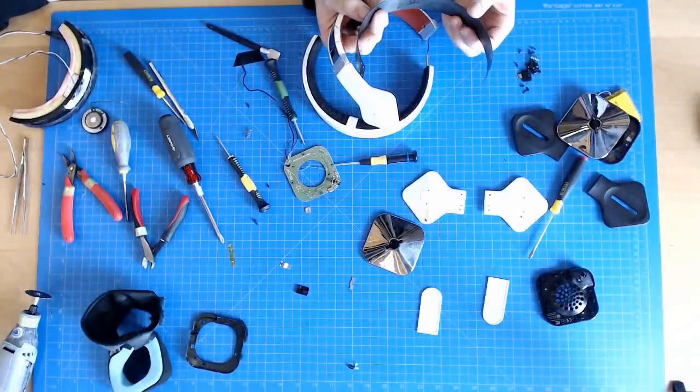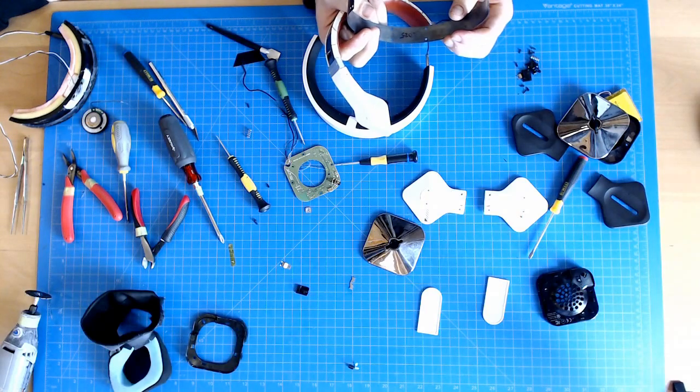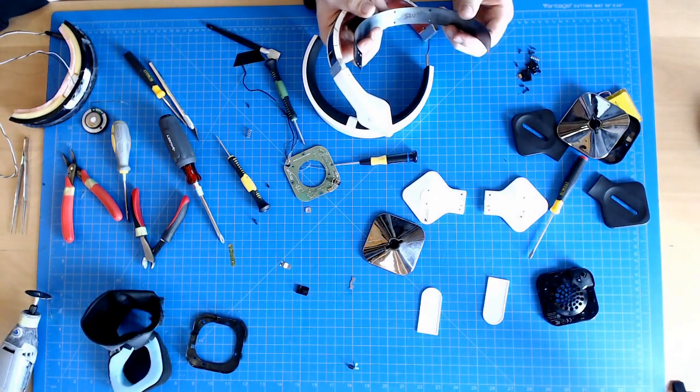And I know that you guys said you prototyped. If I understand the stiffness correctly, we have to look at the thickness as well as the width, right? With a little bit, yep. If I remember my formulas correctly, it's a cubic relationship to the thickness. So with a little bit of increase in thickness, the stiffness increases by a cubic factor. So it's really sensitive to thickness. So we have to balance because we don't want to make it too heavy. Okay. But we need to make sure it clamps down with enough force.